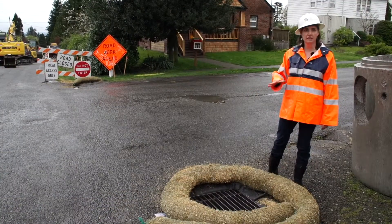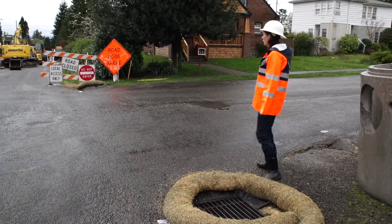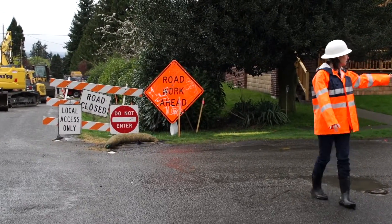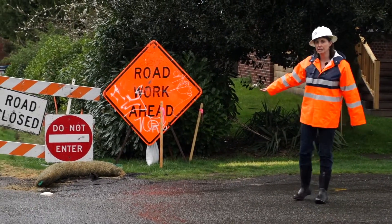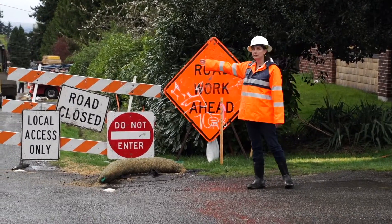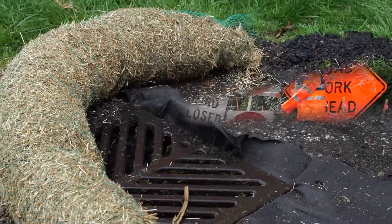This project drains to Piper Creek's watershed, so it's really important to keep sediments out of the creek and within the job site. Over here, they're doing something different. This street has no drainage — all the water runs down — and without this added measure, a lot of water during a large event could cut over and go into the project site, which is not what we want. So they put a wattle around this drain to make sure the water gets into the drain.